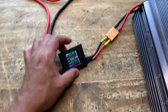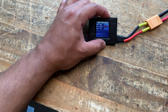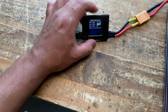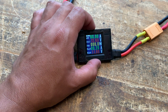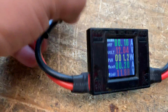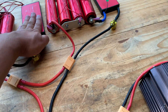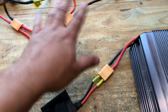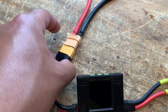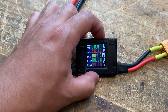I'm not sure what's going on here — okay, let's see. Ah, come on. Okay, here we go. So it's showing 12 volts — why is it not starting? Oh, 12 volts — see, it hasn't started. So you have to remove the load. It should be 24 volts. That means this one was off and this one was on — that's why we were only seeing 12 volts at the end. When both are pushing 12 volts it becomes 24. Now disconnected and connected back — I get a little spark — then you click this one and there it is, 26 volts.